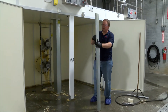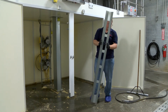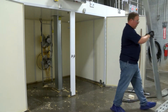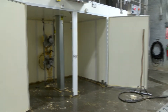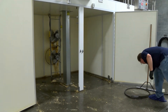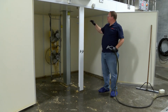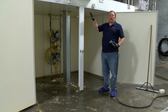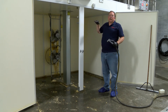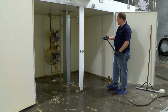This is the air diffuser, and that has been removed — it'll be cleaned in a little bit. At this point we're going to go and rinse down the hatcher, and then after that we will squeegee it out, and then soap it, scrub it, rinse it, and sanitize.